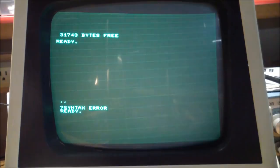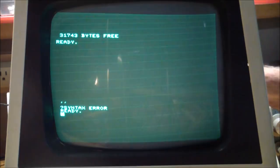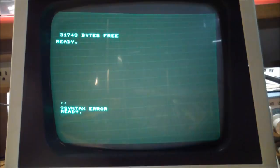And what else do we have? Vertical linearity. Wonder what that is. It's a dirty pot, that's what it is. Okay, and other than that, I don't think there's any other adjustments in here. So the monitor may need some work after all,